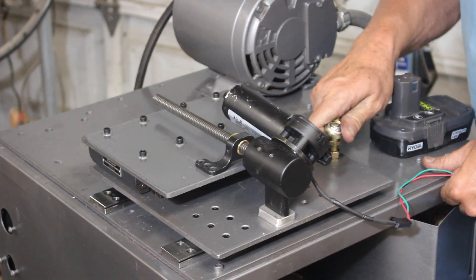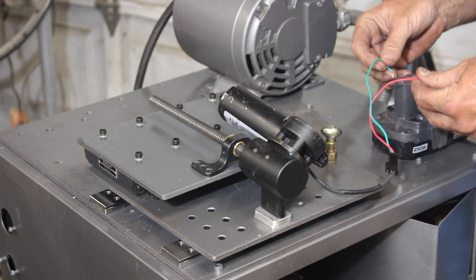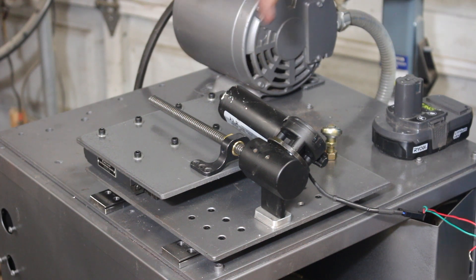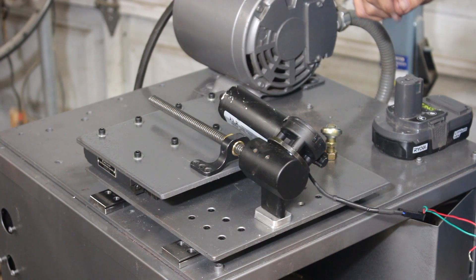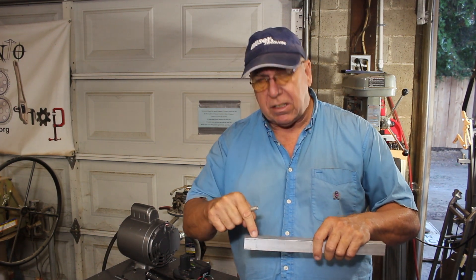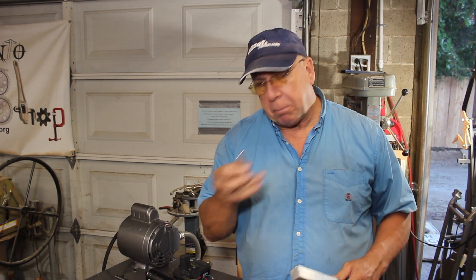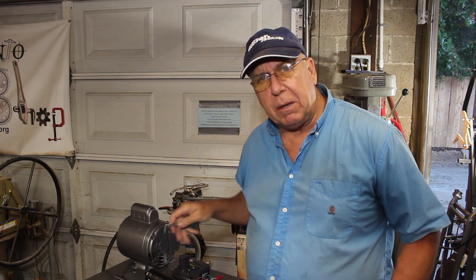We've got our x-axis moving and our y-axis with the drive hooked up — let's test the drive. Okay, that's working too. Now we just need to build the fixture that will hold the stock and the clamping mechanism, then we can align the cutter bit and test it out. The next step is to build the stock holding apparatus. This is the stock — it's a 3/8 inch aluminum tube. I'm going to drill a 3/8 inch hole into the bar, cut that hole in half, and that will make a perch for the tube to sit on. Then I'll make perches for toggle clamps to lock the workpiece into place so it can be fed into the milling cutter.